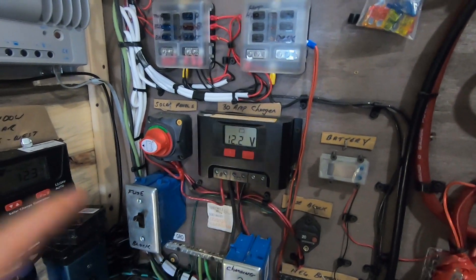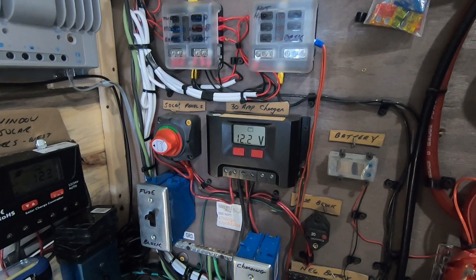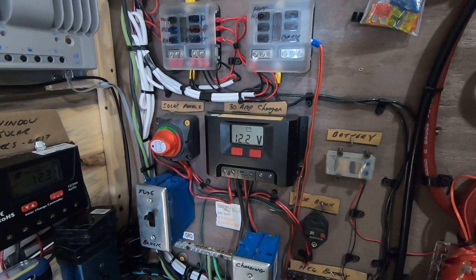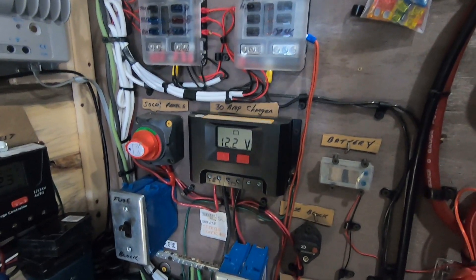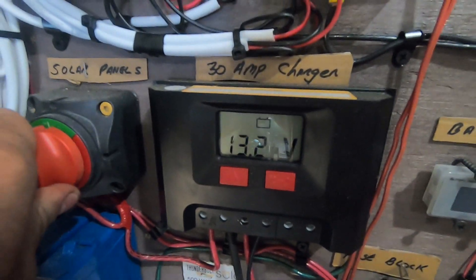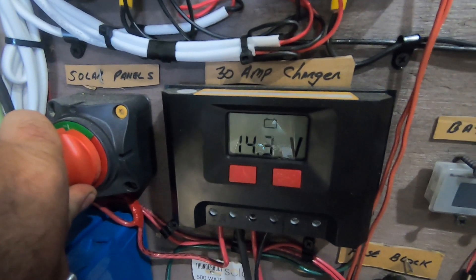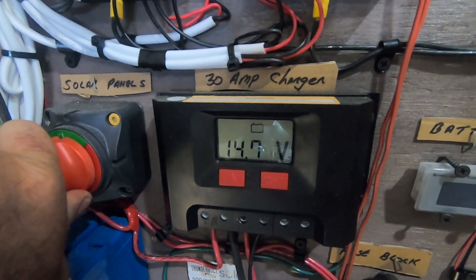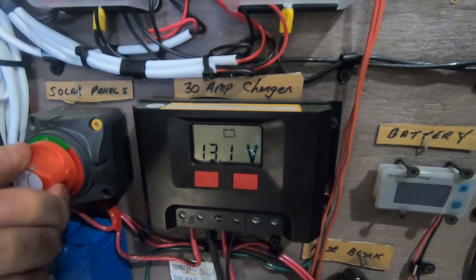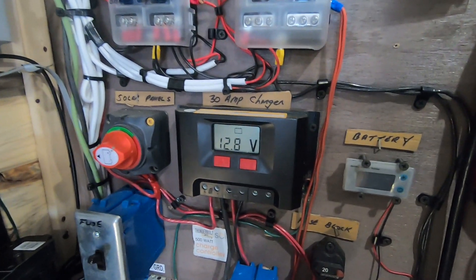The reason I'm getting so much voltage is these controllers are good for about 200 watts and I'm driving 400 watts. It's rated at 500 watts but in reality they handle about 200 watts. So I want to do a little experiment when I wired all this up. Watch the voltage jumping all over the place — you can notice the lights flickered off and on. The charge controller had to keep up and figure out what was going on. I'm getting full sun right now. It's already charged the battery bank pretty well, so it's working, but I don't like it.